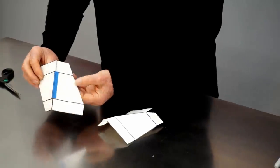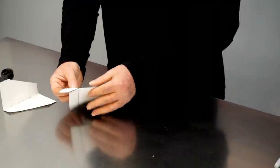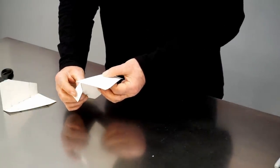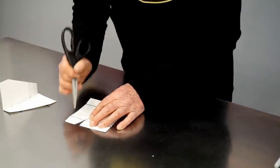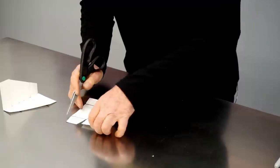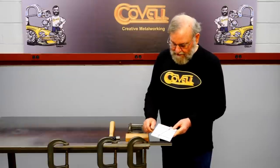This is the simpler of the two parts — it's just an angle, and the flanged areas don't need to be bent; they'll just be a continuation of the plane formed by this side of the part. The second part is slightly more complex because one section bends this way, this gets bent in, and this gets bent out. You can see that if I make a cut right on this edge, that will fill in the missing triangle. So now we'll cut out two pieces of metal from our new patterns. It's very difficult to maintain close tolerances with a simple bending fixture, so I've made my part a little wider than needed — about two material thicknesses on each side — and you'll see how I use that extra metal in the next step.